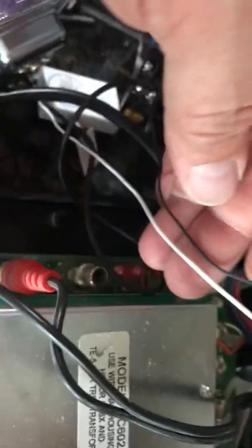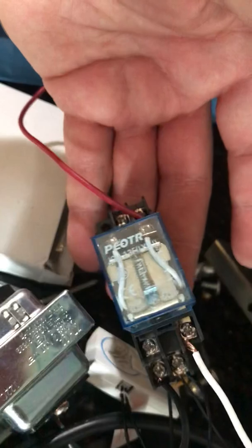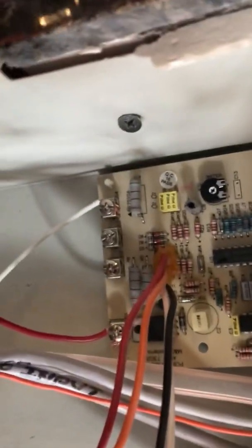The leads from the actual doorbell come down — one side goes to the transformer, one side goes to a relay with the power module right here. This relay switch isolates the two circuits. When the doorbell is pressed, the electromagnetic gets charged, and the red and white wire on the old M&S system here and here is activated.